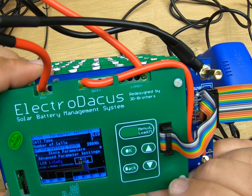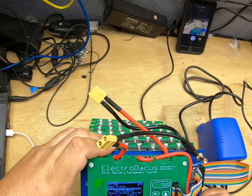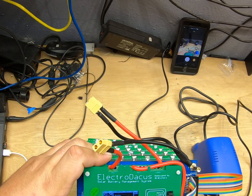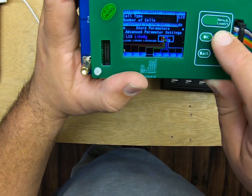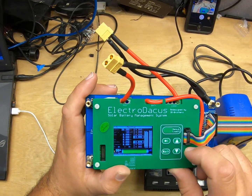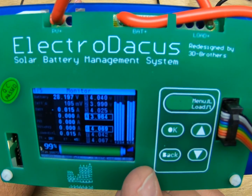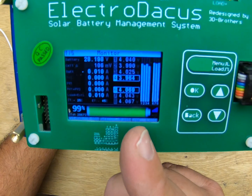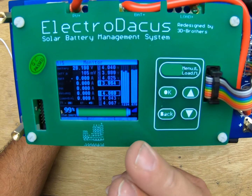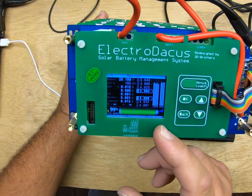As you set the cell count it updates the wiring diagram. We'll go back to seven, say OK. By default it's set to 200 amp hours — once you know your pack size you can configure this. I'll back out of that and leave it at 200. Click the back button and come into monitoring. You can see all the cells, and there's a gap in the display — that's because this is set up for 8S but we're using it for 7S, which is just how this BMS has to see it.